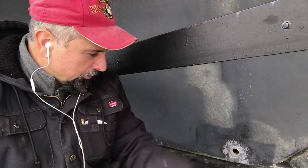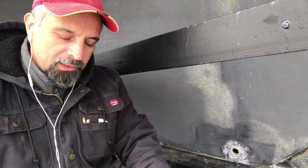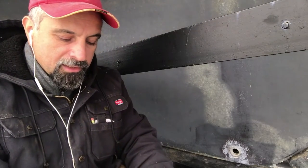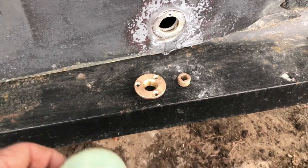There's a lot of value in keeping this garboard plug. I have to plan for all contingencies: if I sail to northern latitudes, haul out, and I'm away from the boat for any period of time, water can get into the bilge and freeze. If the drain is plugged up, that could crack the hull — so that's my justification for keeping it. The plan is to through-bolt it right through the hull.